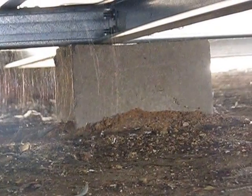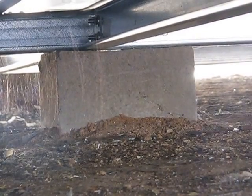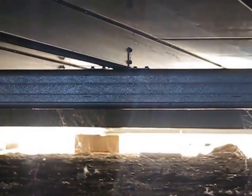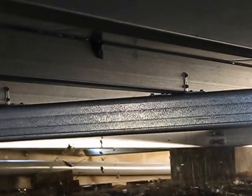Once you got around the problem of just setting up your concrete blocks, it was really just a socket set and a tek gun. Those floor panels are shot down. I glued them as well as screwed them down, with some 65mm countersunk metal drilling screws, so the whole floor is screwed down, and used liquid nails as you would normally use to stop any creaks and stuff like that happening. So yeah, that's the subfloor. Simple concrete block, simple C-channel on the blocks as bearers, orthodox style C-channel as joists, and then structurally insulated panels as flooring.